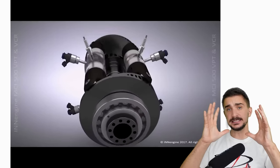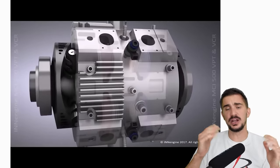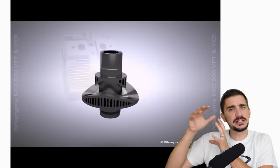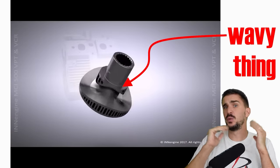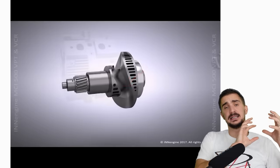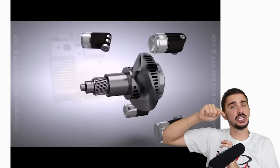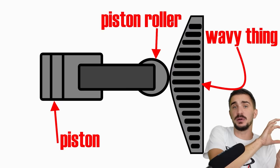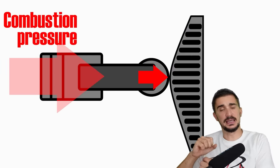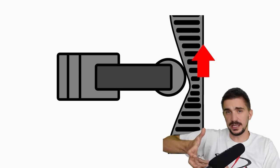As you can see, we have eight pistons in an opposed piston arrangement. We do not have a cylinder head or a crankshaft. Instead of a crankshaft we have this little complex-shaped wavy thing — I'm going to call it a wavy thing because I don't have an appropriate word for it. The pistons ride on rollers which ride along the surface of the wavy thing. As combustion force pushes on the piston, the piston pushes on the wavy thing, and as the rollers go down the slope they force the wavy thing to rotate.